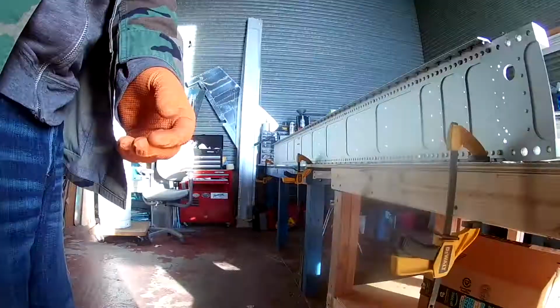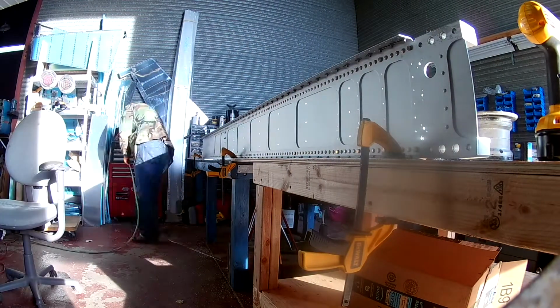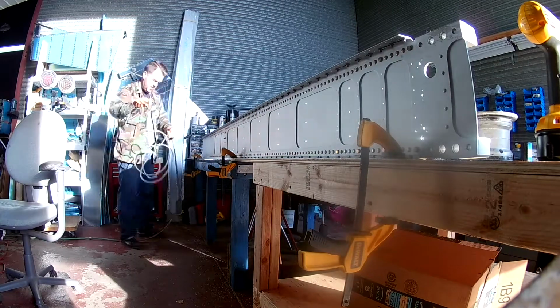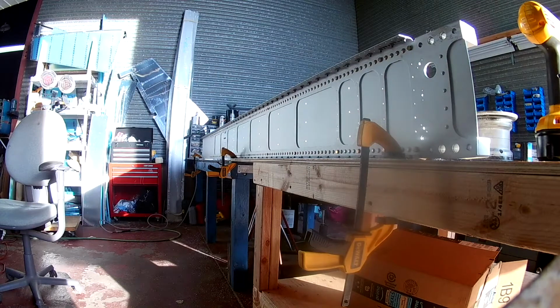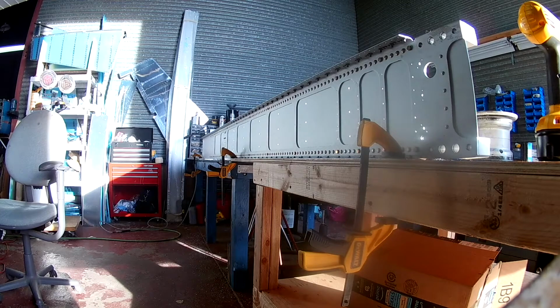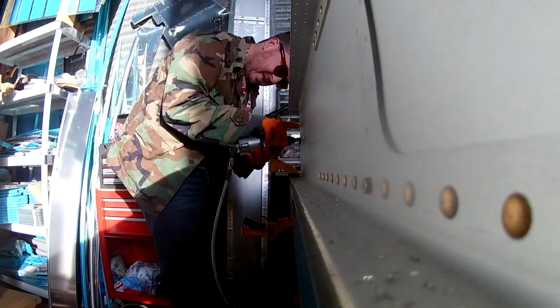The only thing that's really detachable in this whole wing is the fuel tank. Anything else that you have to work on, you have to reach through an inspection plate. And the smallest holes are the ones where the spar will meet the ribs. At the top and the bottom, each rib has two number 40 holes that are meant for AN3-3.5 rivets, I'm pretty sure.